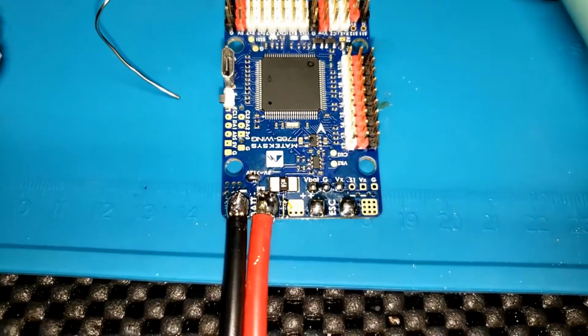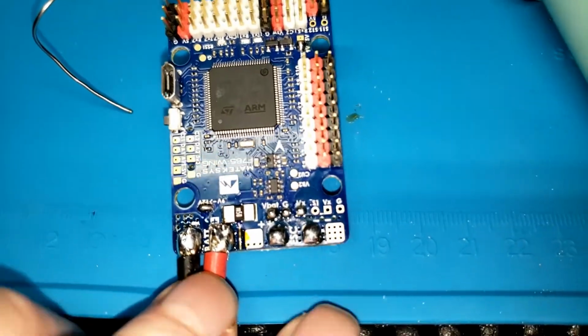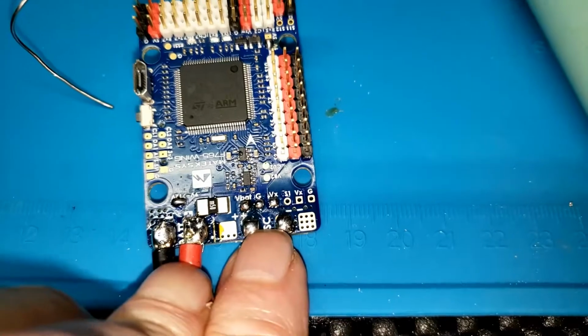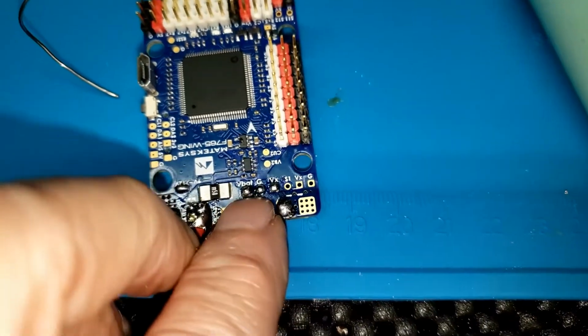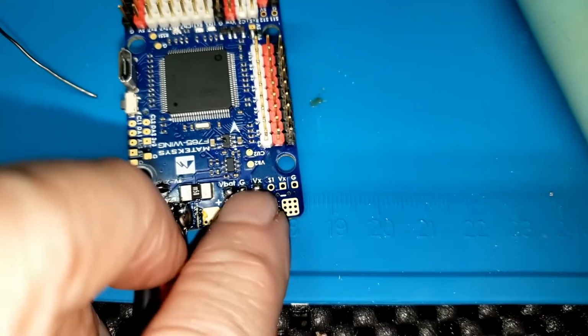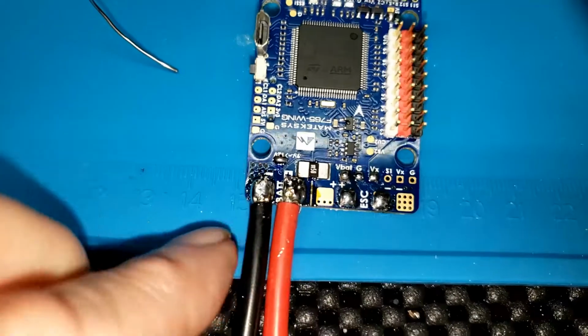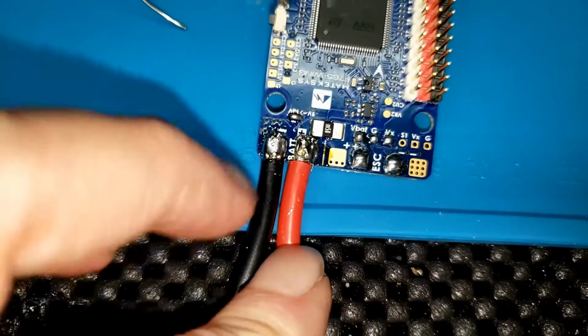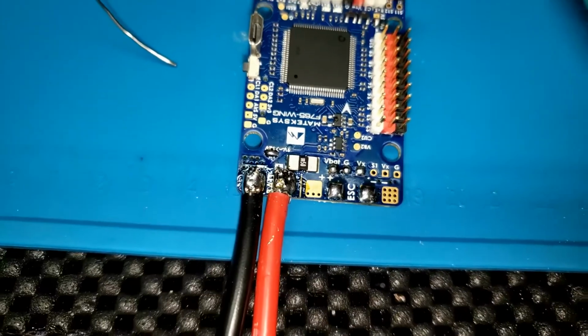Well, there's the battery leads. 5 more to go. I think putting these 2 on and then putting the wires across with a solder helper and just touching that real quick on those 3 right there is going to be my best bet. And these, well, I'm pretty happy with those. I pulled on them like my shop chief would have, trying to pull them off the board, and I can't break them loose.